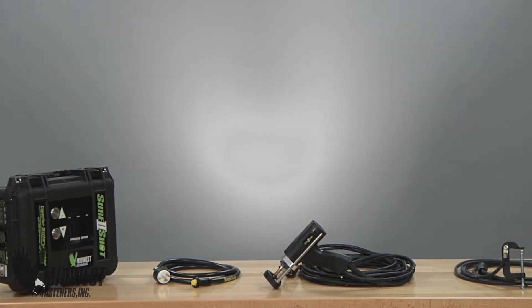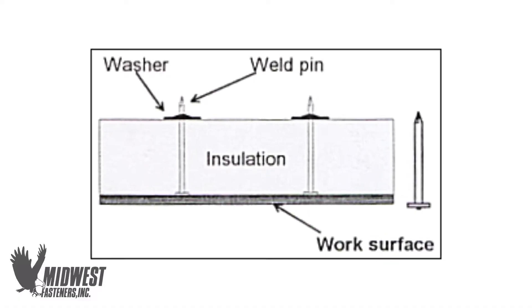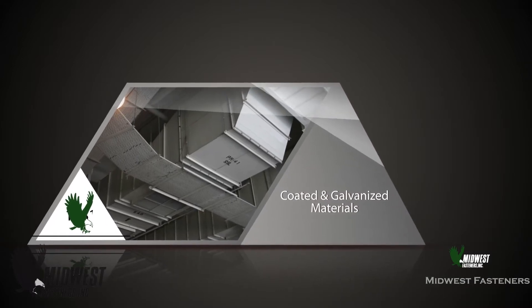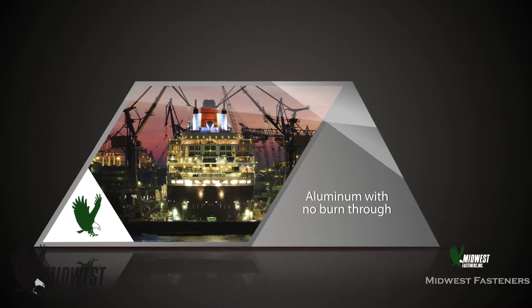Using the CD process for pin welding offers a strong weld quickly and reliably to impale insulating materials. It can be used with stainless and mild steel, even coated and galvanized materials, plus aluminum — with no burn through of the metal and no special welding setup.